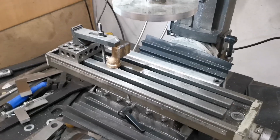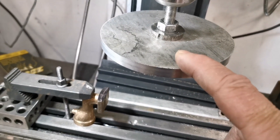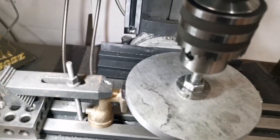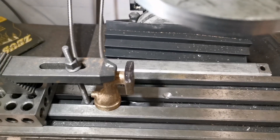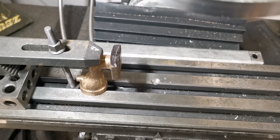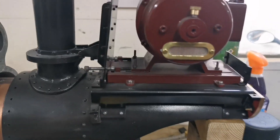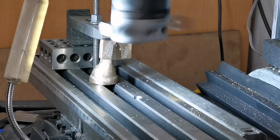As you can see I've got that clamped down tight onto the milling machine. What I've done is I turned a disc the same diameter as the part of the boiler that it's going to be mounted to, and you can see the scribe line. I've got the boring head on there now — I'll machine to that line. It's the same way I did the bottom of the chimney bracket that goes onto the smoke box and the bottom of the generator bracket, and it worked perfect.